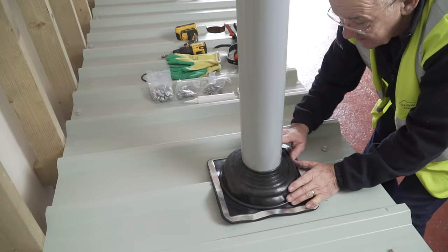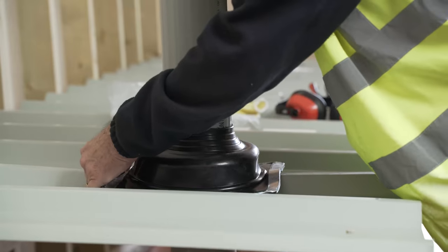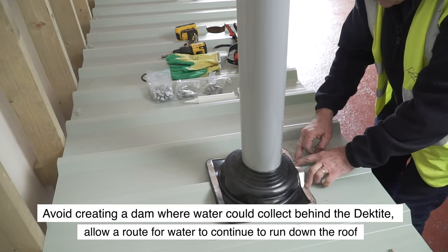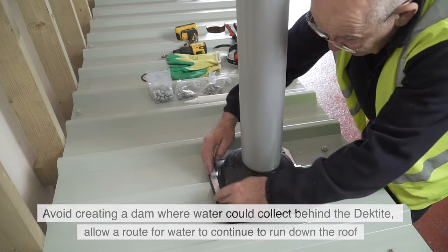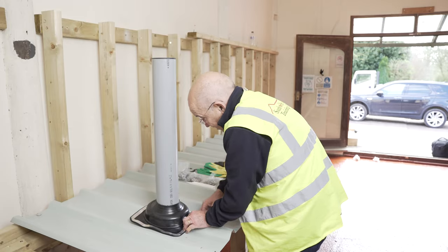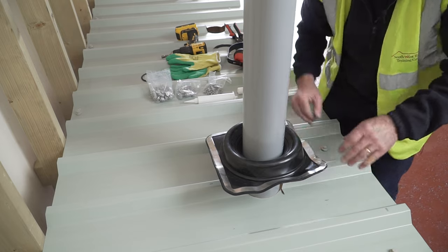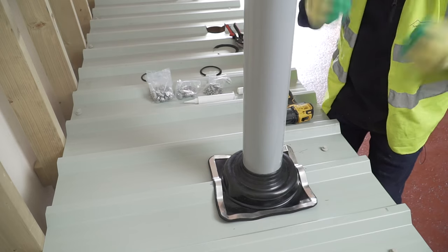Do a snap test — that's the sound you want. Make sure you've got it on square. With it being on top of the upstand, get it down into position. Fix it all the way around so that when it's pulled in, you can mark the edge, invert it, and put your mastic just inside the line, so you know you'll get your 25mm cover on the mastic. When screwing, make sure you're in the centre of the metal strip — if you're on the outside it's going to be uneven.